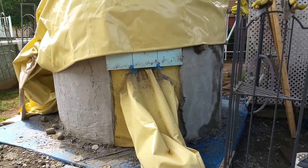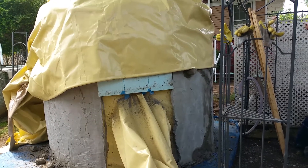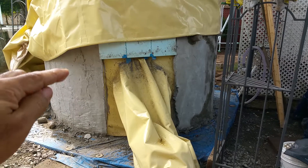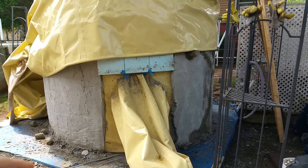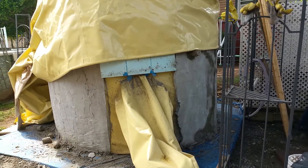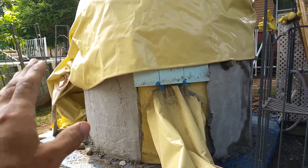I have three ideas for applying aircrete. This was the first, and I built this entire dome just to test my idea — putting a second air form over the entire first structure, bolting it to the ground, and filling in the cavity with aircrete. The reason for the fabric is to retain the aircrete; otherwise there's no way the aircrete would stay to the wall, because it has a high flow rate — it flows like water, so you'd pour it on and it would just flow away. You need to contain the aircrete inside that space.